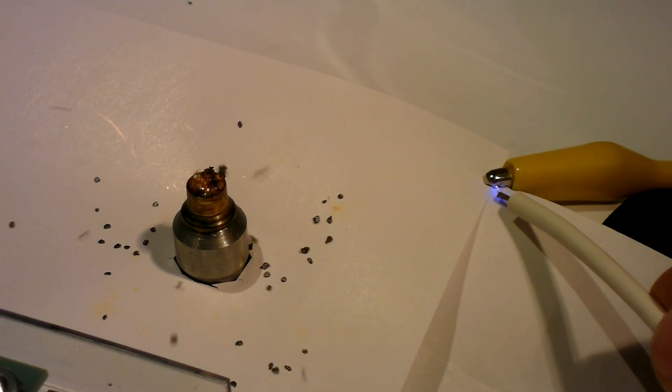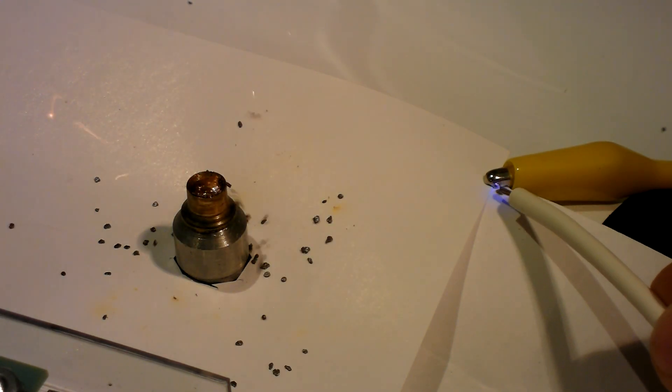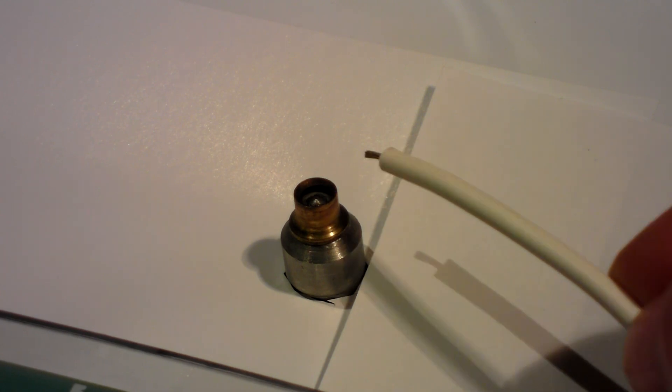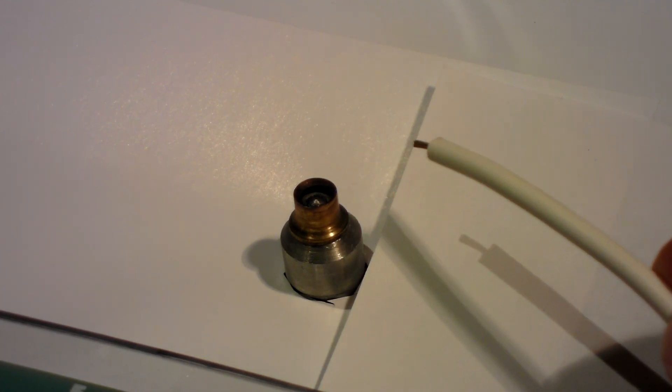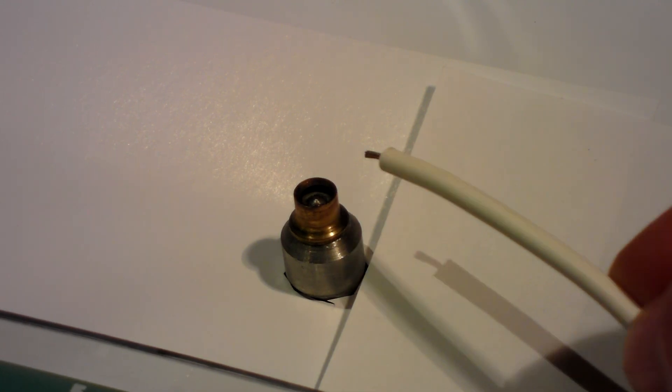This is not too bad a fault, but I wanted a system which fired instantly when the trigger contact closed. To do this, I needed a system with a high enough voltage to pass through a non-conductive powder like smokeless, but enough energy to instantly ignite it — much like the resistive heating used for the black powder. One characteristic of an electric arc, or spark, is that once the voltage can jump the gap and start the spark, the ionization of the air greatly lowers the resistance, so it takes much less voltage to maintain the arc. This principle may allow an electric ignition where we start with a weak spark, but then use that spark path to pump a lower voltage but high current through the powder, creating a lot of heat and hopefully igniting it instantly.